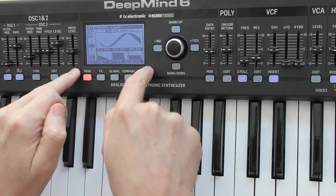You can move the effects around, and where it really shines is the ability to change the routing — all in parallel, two in parallel, all in series, or feedback configurations that feed back into slot four. There's a 30Hz cutoff filter to stop really nasty feedback effects, which is a nice touch. You can easily modulate those from the Mod Matrix, which seems fairly common now but used to be really rare.